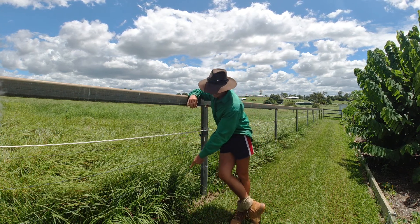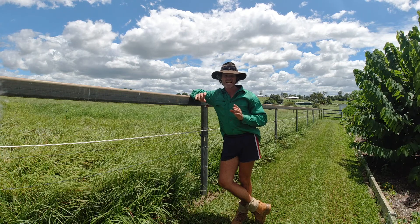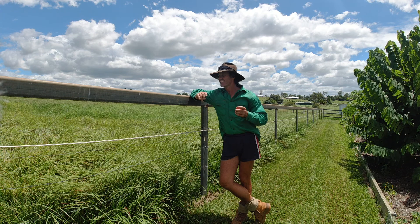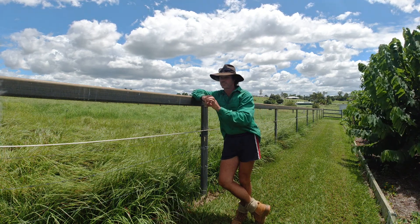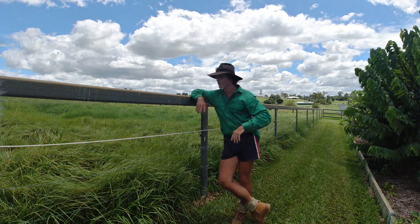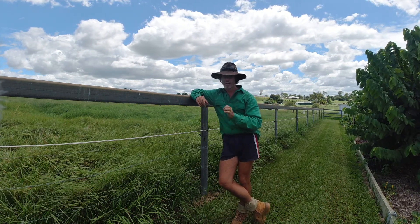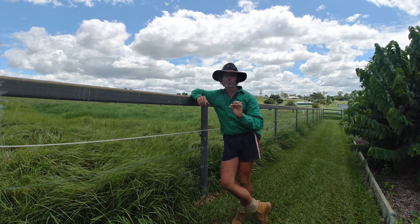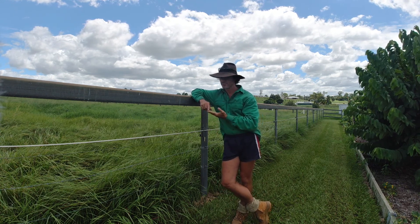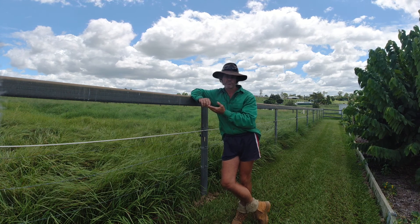What I want to do first is check some insulators that have broken down — either through UV damage, they've dropped off the nuts on the system, or the plastic on the insulators have cracked and dropped off. Also, where I've gone under gateways I've used insulated wire to go under the gateway and then connected it back up.